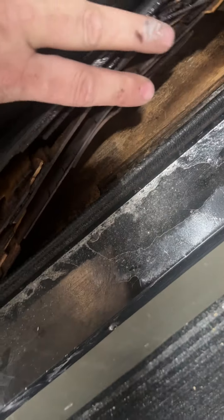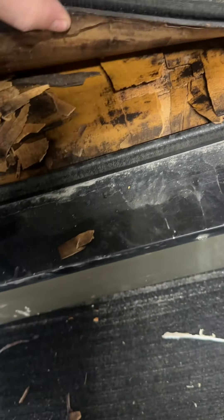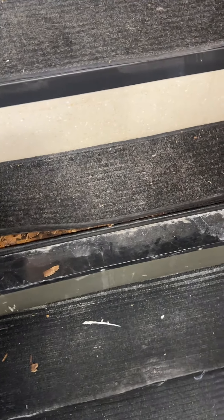Sometimes it's still wet — that's how you can check. This normally has glue underneath the step tread, and over that it has screws — right there in the corner, you can see the screw there. That holds it down. You can take the step tread up and check underneath. We change a lot of these out and a lot of people don't even know that's there.